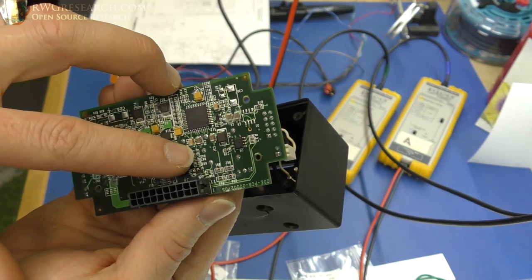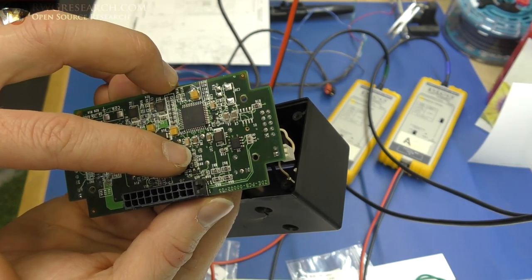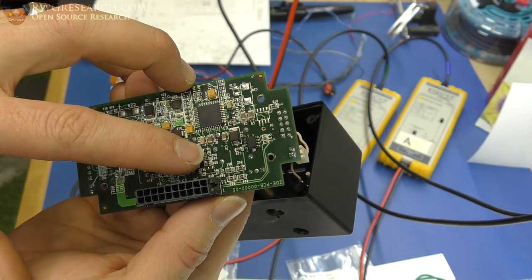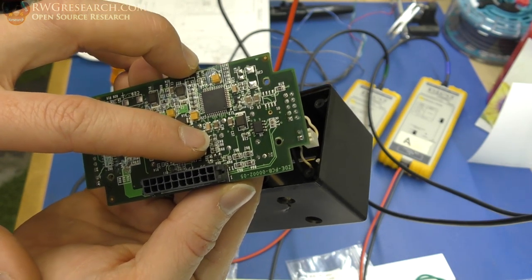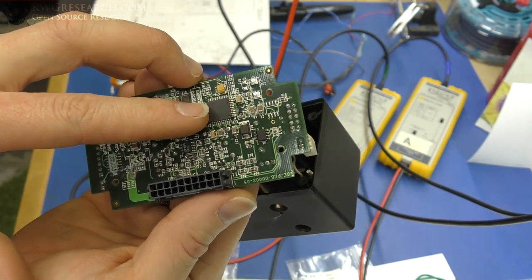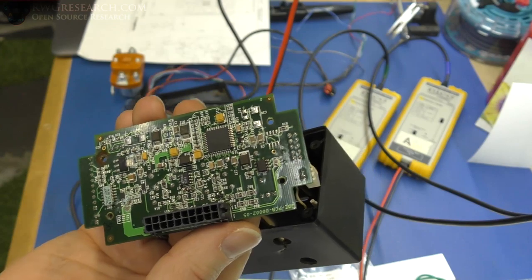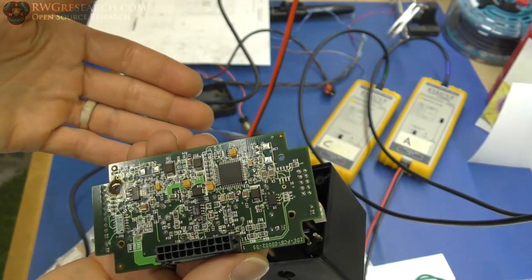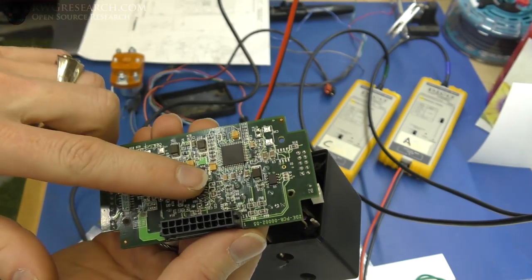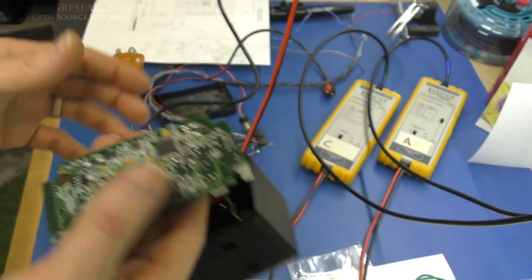But what I realized is this output is probably an analog output, because it only goes up to about 1.8 volts. Now, that could be a circuitry design, or that could be the fact that the analog output only runs up to 1.8. And that actually is true for the BeagleBone. It's a 1.8 volt output. So they're scaling from 0 to 1.8 across this capacitor.